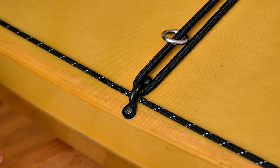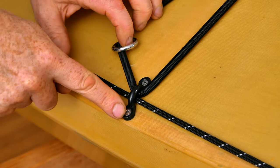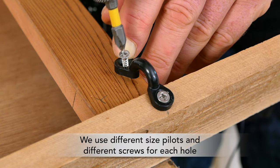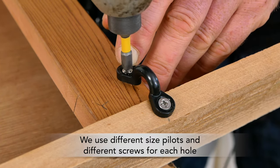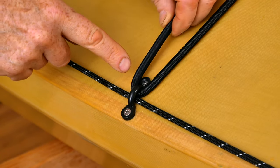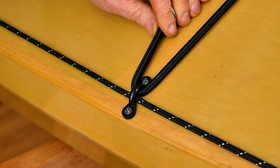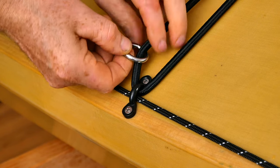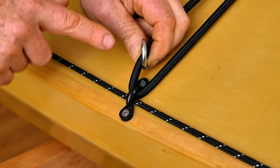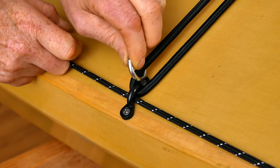Moving back a little further — about a third of the way between the mast step and the cockpit, you'll come to another nylon pad eye that's partially mounted into the gunnel and also partially screwed into the deck beam. This particular one is a little bit tricky, so definitely watch the perimeter line installation video before you try to screw this in. Once you've got this in place, the standard deck rigging has you tying a 5/16-inch bungee in a loop over to the other side. But if you're going to be adding a sail, when you tie this bungee loop you also want to put a little ring on the side of the loop closest to the cockpit. We're going to feed the sheet line through this up to the boom, and it can slide back and forth on this bungee to act as a traveler.